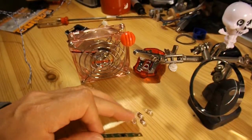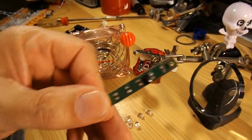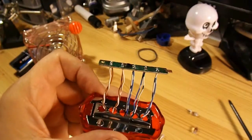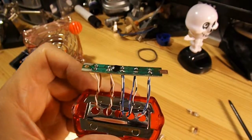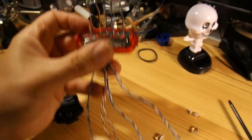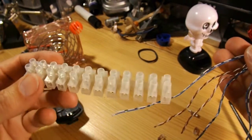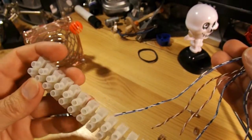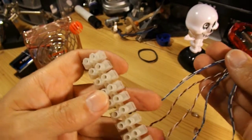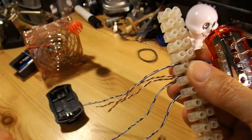Well that worked out nicely — those LEDs came out very easily. So I should be able to put some lengths of wire in there and extend it out for the eyes. There's all the wires put in place to extend the LEDs, so I'll just stick that back together. I've put fairly short wires on, because what I'm going to do is put them all onto what I would call a chocolate block — electrical connectors — so that I can then connect whatever length wires I want to go to the rats. Then I can put extension leads on out to the individual rats.